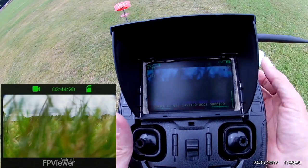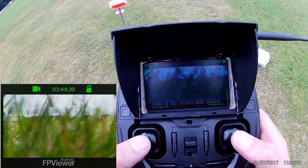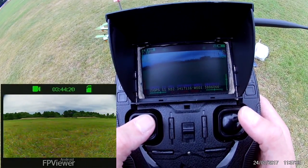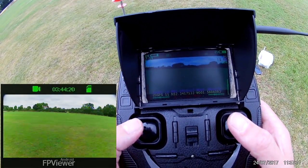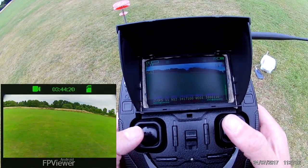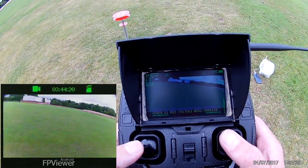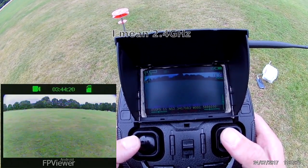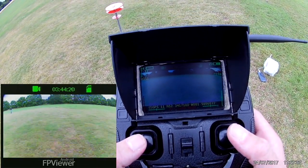So I'm just going to do a little fly around and see. The way I consider these antennas is, not only have I upped the gain on the signal that I'm trying to receive, but I've upped the gain on all the other signals going around at this frequency. If there are other 2.4 gigahertz frequencies going around, now I've got a better ability to receive them. And that's not such a good thing